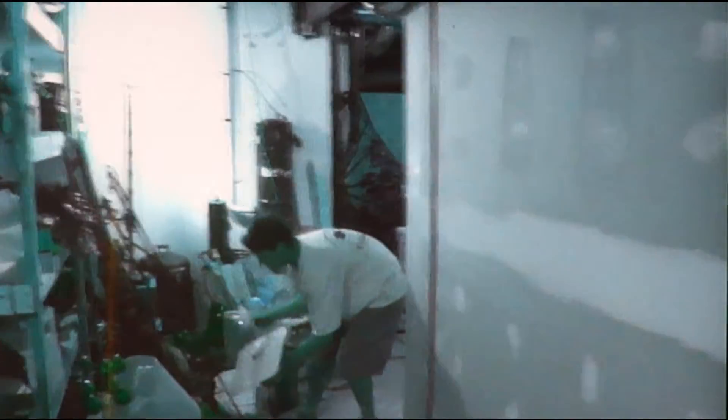Puts it on, cleans it off, clean this up now here, and I'm just going to grab a little bit of that mud here, and we're going to take care of this factory joint here in the middle. So this has been two-coated, and we're going to apply the third coat, and we're just going to bring it out a bit here.